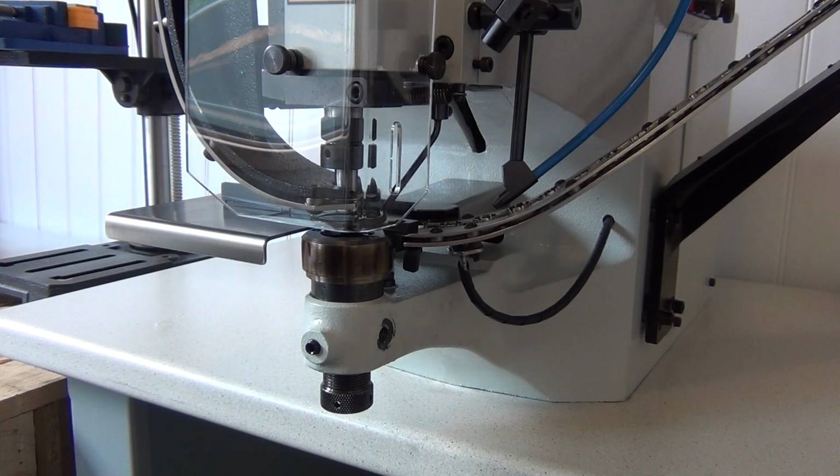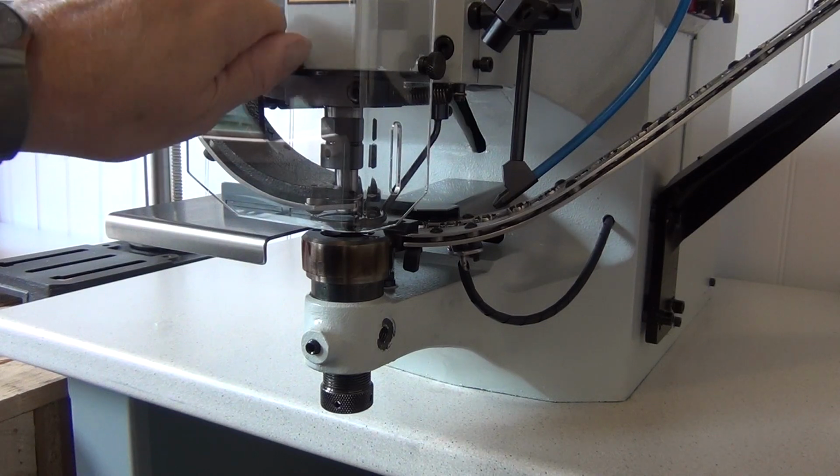As you follow this procedure, you will need to connect the machine to power sources at various times. Make sure that you disconnect it at any points where you are going to have your hands in the danger area. Now let's proceed. Begin by removing the protective guard over the die set area.